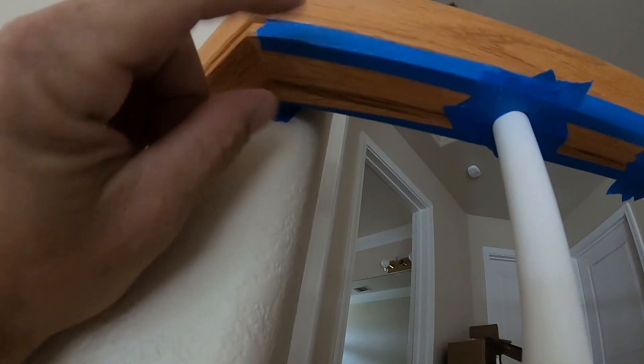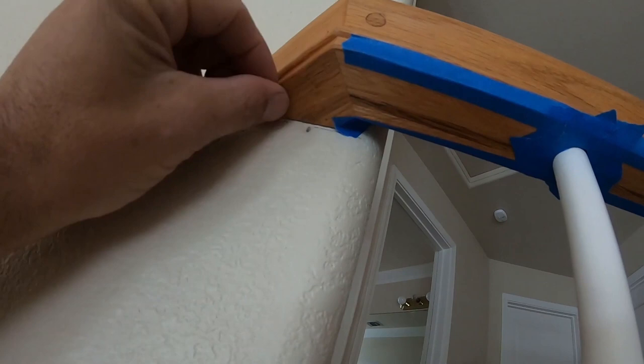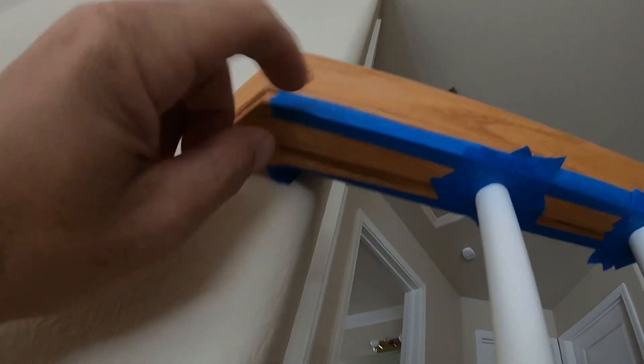First I like to run a small — this is half-inch blue tape. You probably want to use blue tape or frog tape, but on anything that's like stained or lacquered like this, you can end up pulling the finish off. So we use delicate surface tape to prevent that from happening — that's a little pro tip for you.